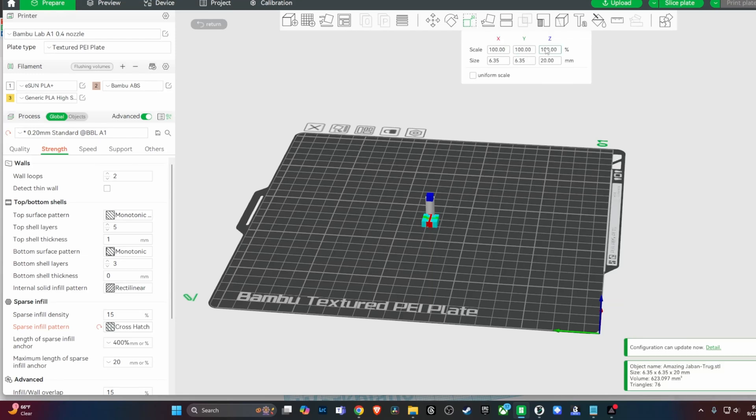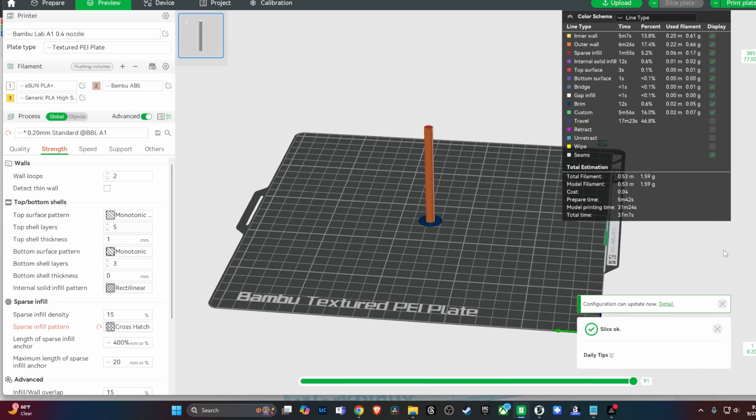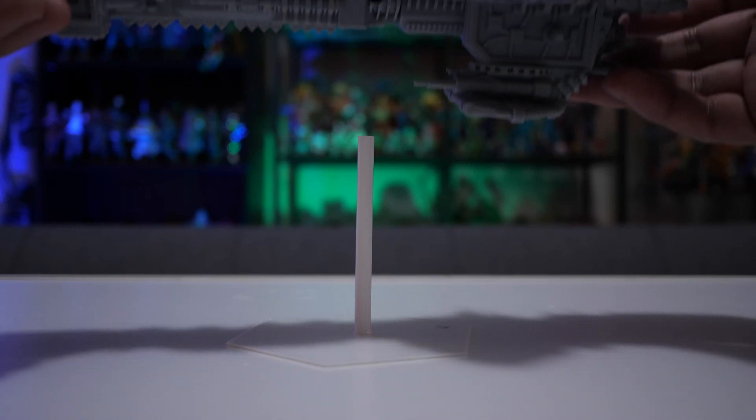The dowel needed to be longer to avoid the intricacies of the ship. So I grabbed that old red ruler again, measured from the base to where that hole is roughly, and it was around three inches. I went back to Bambu Studio, went to the scale setting, turned off the uniform adjustment, and changed the Z height to whatever three inches is in centimeters — somewhere around 76 or 77 millimeters. It made a long stick and I printed that. I stuck it down in the base — which was kind of flimsy because I'd printed it thin. I was impatient, but I stuck it in there, it fit, and I put the ship on.